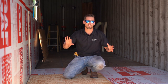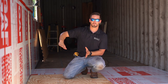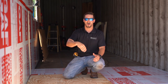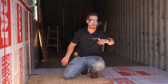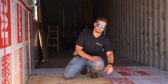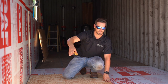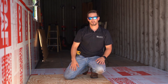In our case we're doing the build a little differently to show you raw insulated plywood and framing throughout the container, so follow the directions we're giving rather than exactly what you see here. When you do put the plywood in the other direction and butt the seams up, make sure you don't place a seam on top of another seam. Start the first sheet cut to 92 inches or whatever your measurement is, and stagger the seam so it lands roughly halfway across the full sheet below.